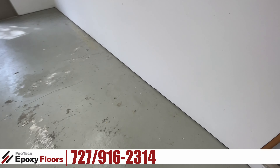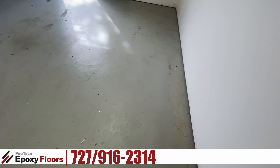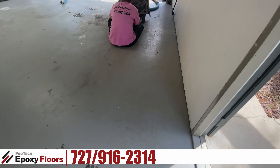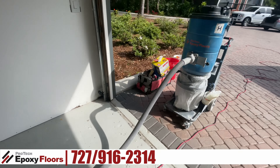This wallboard does not come down to the floor, so we're going to have to build that up. We'll put an epoxy compound in there and do a cove all around. We're going to remove the previous coating. Bill and Lauren are setting up the main floor grinder, and I'm going to be doing the hand grinding. We've got a beautiful view of Lake Tarpon. Let's get started.